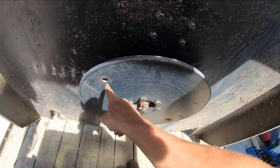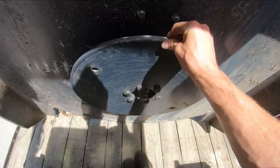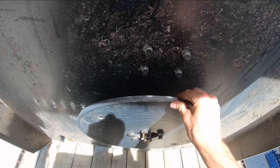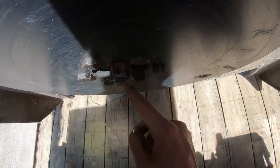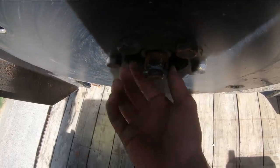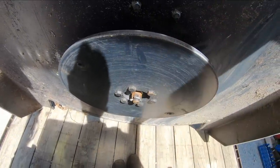I can go ahead and throw the blades back on now that I've chased those threads, but I notice there's a little bit of deflection in this thing. Also, looking at the nut holding it on here, we have the exact same setup as the blades — a castle nut with a cotter pin, but the cotter pin is not down through one of the slots. So the nut can actually back off and run up into the cotter pin before it gets tight. I'm going to take this out of there, take the whole unit off, and see what we're looking at before any further damage happens.